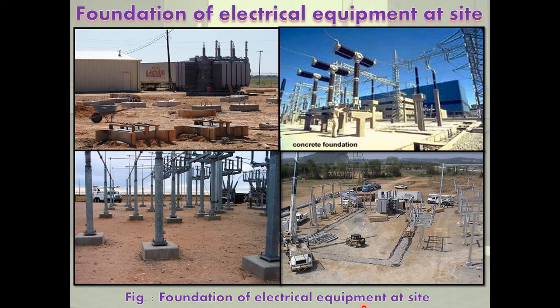In static machines, no questions of resonance frequency arise. In rotating machines, the resonance frequency of the machines affects the foundations. The leveling of foundations is also a most important topic. While preparing the foundations, the top surface of the foundation is leveled — this process is called leveling. Spirit level, trisquare, string, and plumb bob are used for this process.